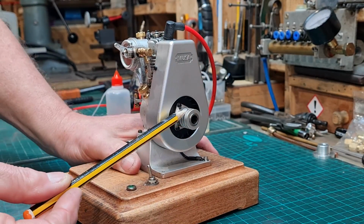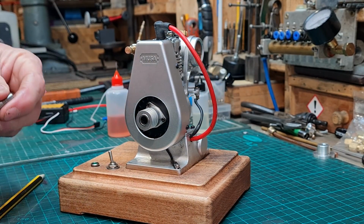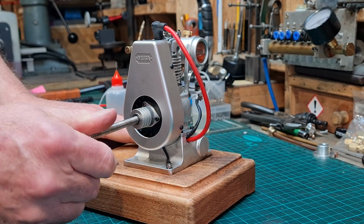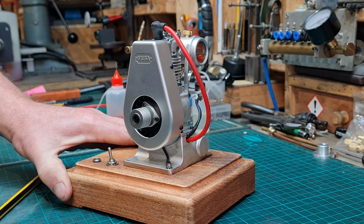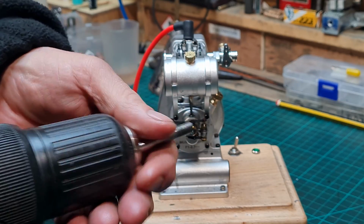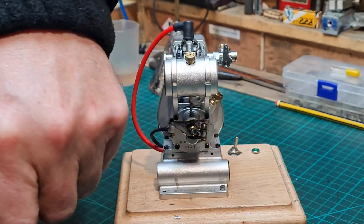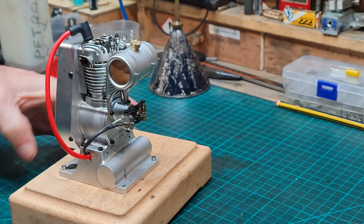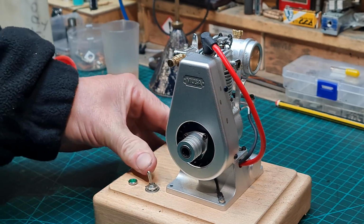There is a nice 3-groove pulley on the crankshaft, allowing connection to drive auxiliary machines, and also doubles as the starting hub, as it is fitted with a one-way needle roller bearing, into which is inserted the 6mm starting shaft, powered by a battery drill. As this is a one-way bearing, once the engine kicks into life, the shaft can be easily withdrawn, as it is essentially stationary now in the engine. A very nice idea indeed, which I think I'll be utilising on some of my other engines.